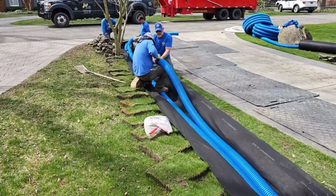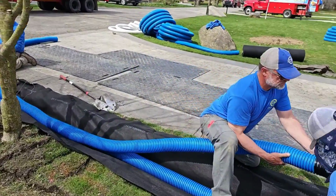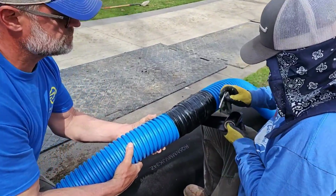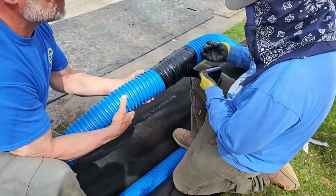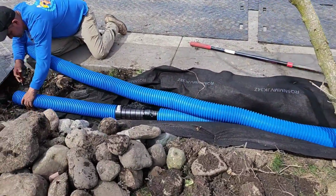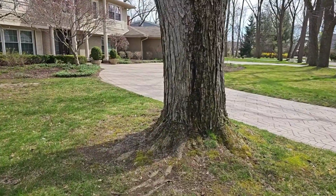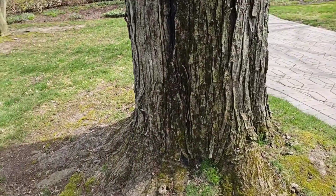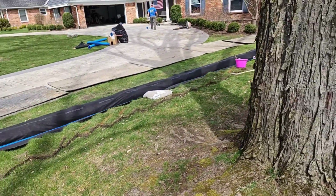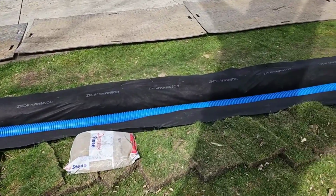Now when you have to tape up a coupler and you're within 50 feet of a big tree, see what the guys did? They weren't skipping on the tape. You throw everything at it because these trees are nasty. If anything takes out your drain system, it's going to be these trees. This tree would be what would take out this drain system. And to take it out on its discharge end, that means the whole system is rendered useless. So we ran solid pipe right through this area.